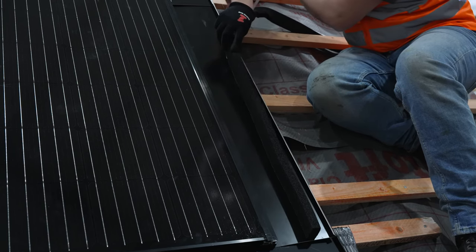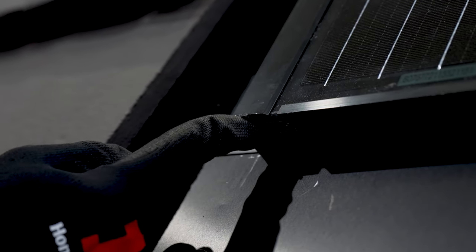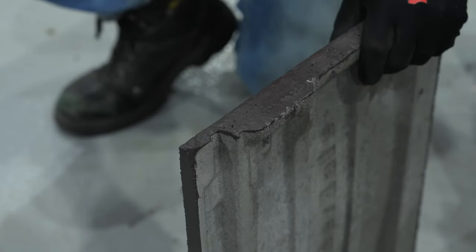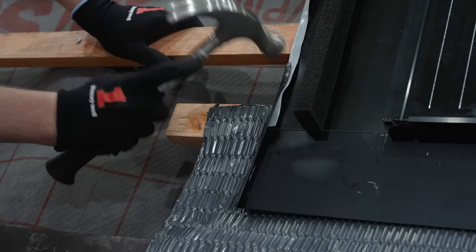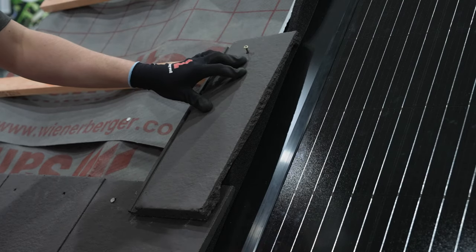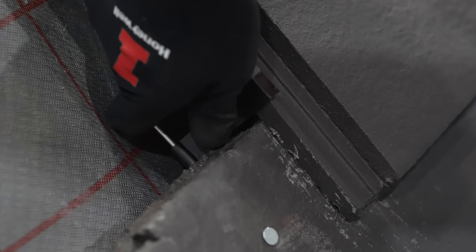Next, install the rubber bungs — one is required at both the bottom left and right of the array. Insert into the square hole on the panel as shown. Depending on tile type, it may be necessary to make some modifications to ensure the tiles sit flat. Where tile nibs clash with the aluminium flashing, remove them with a hammer. With flat tiles it is also acceptable to flatten the flashing edge upstands to ensure a flatter fit. With those modifications made the tile should sit flat. Do not mechanically fix the tile through any nail holes that would puncture the aluminium flashing — alternative methods of fixing should be used when required. If the tile is still not sitting flat, use a screw fixing to better hold the tile in position.